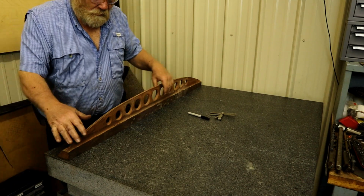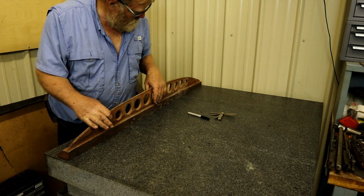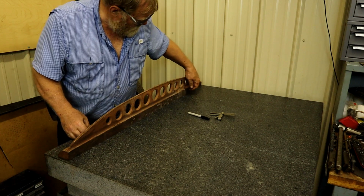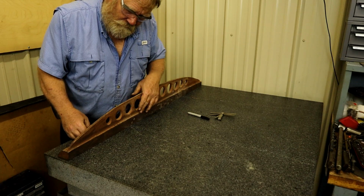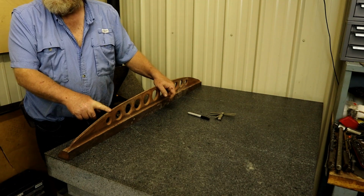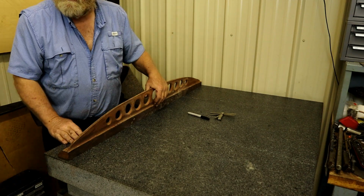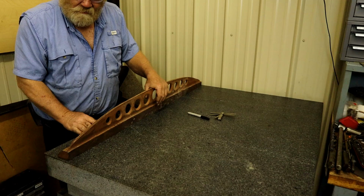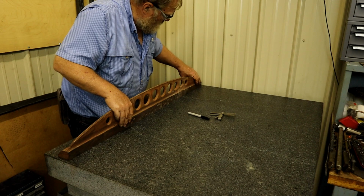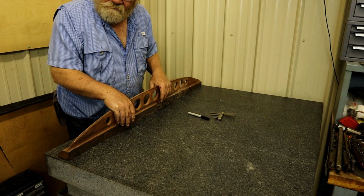The problem with long castings like that, especially when they're thin, is the heating and the warping and stuff. See, this thing is not even all the way down. Nah, that's from the mold. Yeah, and a lot of times patterns, as they get used a lot, get cattywampus. Oh, we'll get one more out of it. Back then patterns were really expensive. Today you can print them a little bit easier, and even CNC one out of a thermoplastic.